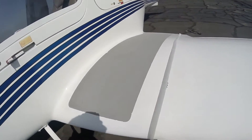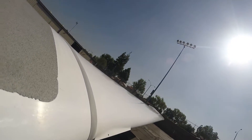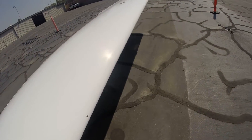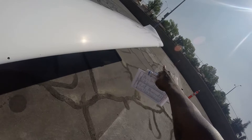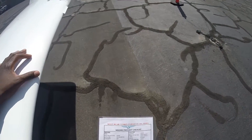Check your wing surface. What I usually do is start from right here and look through it, using my hands to go through all of this. While I'm doing that, I'm checking the stall strips — which is this. One is right here and one is all the way at the end over there. All of that looks good.